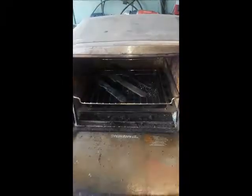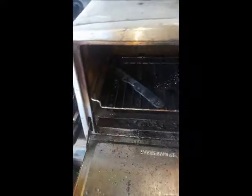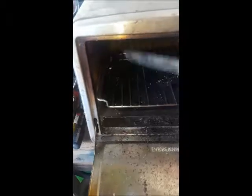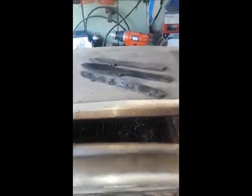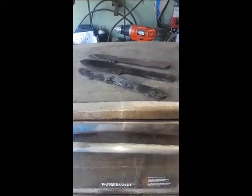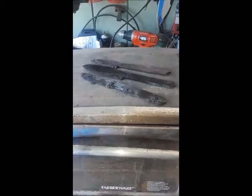Alright, it's that time — let's get them out of here. They're still fairly hot, but now they're in the tempered stage so they're not so brittle. I'll let them sit out here for a minute to let them cool so they can be touched, then sand them down, get them clean, then sharpen.